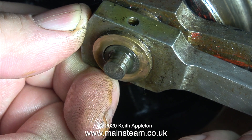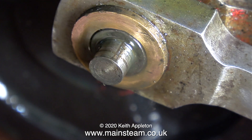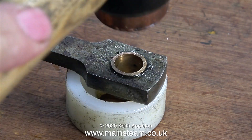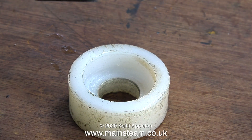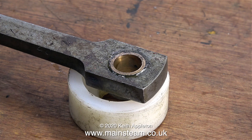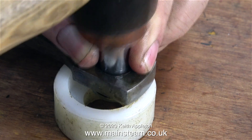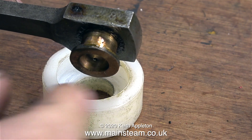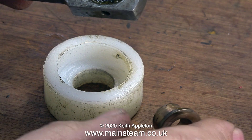Here's the reason why I'm removing the connecting rod: there's a tiny bit of play in the bush — and by slight I mean an awful lot really; I was merely practicing the art of understatement. This phosphor bronze bush has to go, so I'm tapping it out with a hammer. I'm resting the connecting rod on a piece of nylon to avoid marking it. Here's a good tip: if you're going to knock out bushes from connecting rods, use a socket that's smaller than the hole.